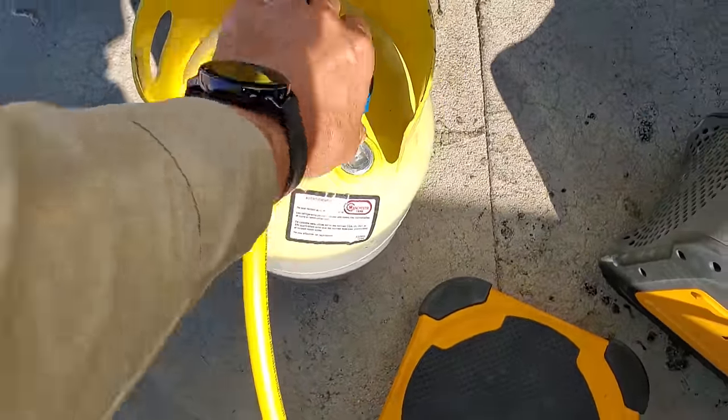What was in there was a 5 cubic inch dryer. I'm gonna go ahead and oversize the dryer. We're gonna put a catch-all in there. We're gonna go with a 16 cubic inch. I don't know what caused the restriction yet, but I do know that whatever it is, I don't want it to plug up the new dryer potentially, so we're gonna go with a bigger dryer. We will have to compensate in the refrigerant charge a little bit, but we'll make sure we get it in there and get it strapped down appropriately.